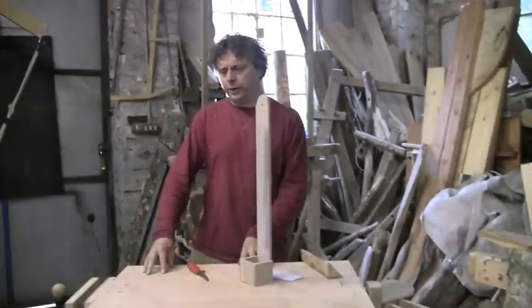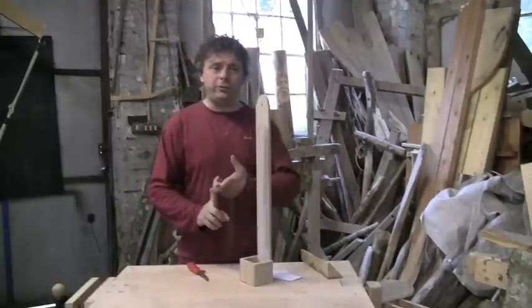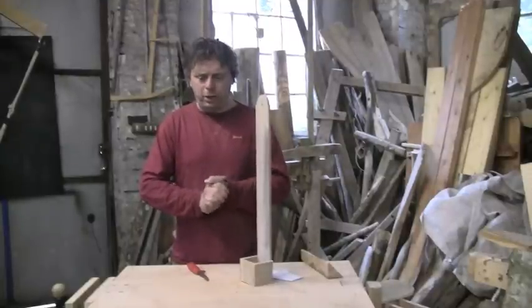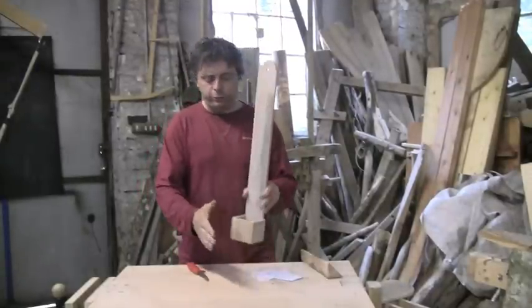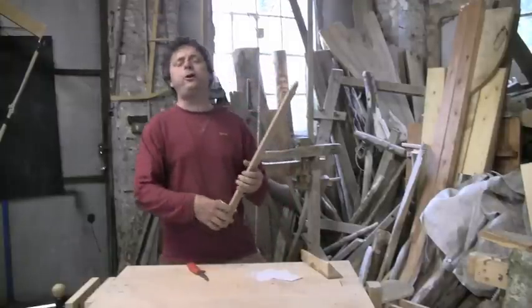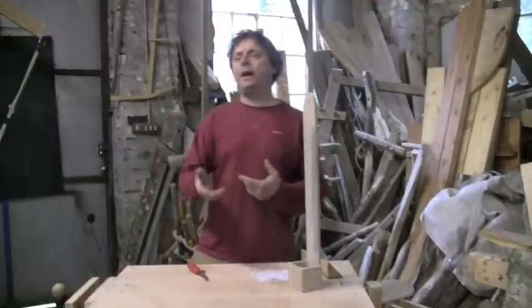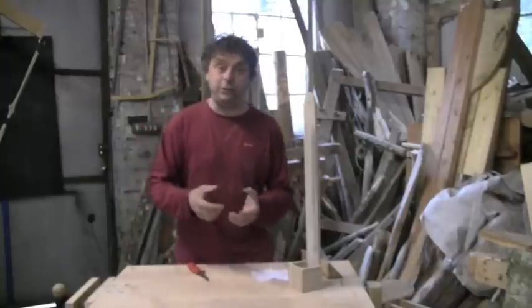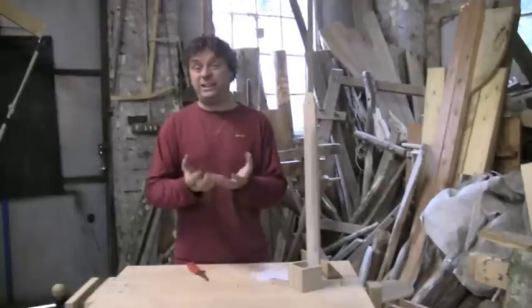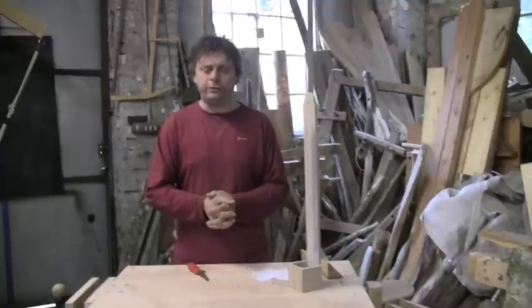We can use other grits, and people used a whole variety of things, whatever they could get hold of. One of the favourites was red tile, or red brick, basically ground up brick or tile. And again, that was just put in the little box down the bottom, tapped out when needed, and spread across. Obviously, the finer you can grind it, the better. People also used sharp sands, and again, it's best if you actually grind them down. A lot of river and beach sands is actually rounded, so you need to create the sharp edge by fracturing the grains.